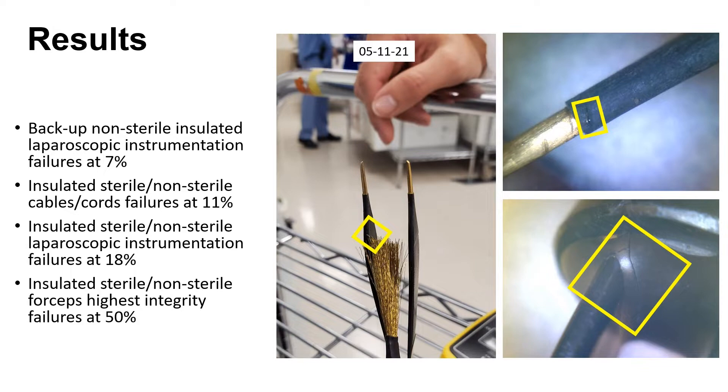As you can see in these pictures, these are examples of what could be found. On the left, the device is being tested and you can see it arcing toward the distal end. On the right, there's a lesion close to that distal end — if you go slow during testing you'll find it actually fails. With enhanced magnification you'd find a lesion. Also, the proximal end — typically the weakest point of an insulated bipolar forcep — is the base, where a split can happen around the tine, which could cause an OR fire or burn the surgeon or scrub tech.